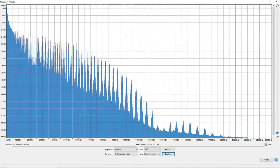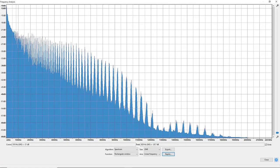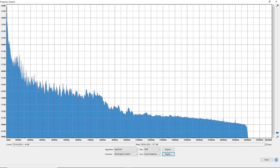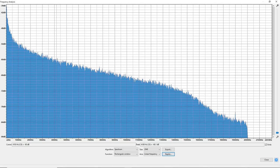Now we are looking at the frequency response. This is 0 dB and that is at minus 20. There is a big knee on there and that knee is the price we are paying for having it driven so hard — that is only at 0 dB. Looking at the minus 20 response, it gives a respectable showing up to 17 kHz. Now this is the tune and you can see it is behaving as it should do. Now we are looking at the pink noise at 0 dB and the minus 20, and you can see it is very much the same shape — there is a good reason for that but we will not go into that now.